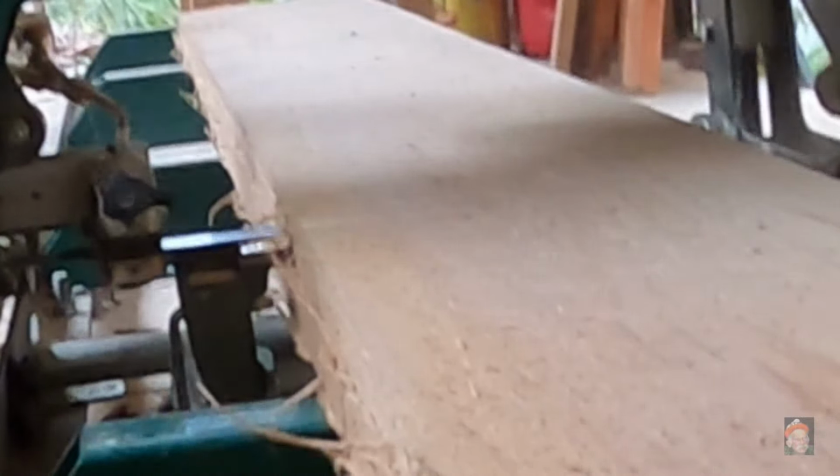I flopped the boards to put the good one on top. I used to have a bunch of wooden log stops that would be perfect for this situation, but I don't know where they are. I have only one left. So the solution is to play musical log stops. The first one is down below the board. After the blade is past it, I will raise that one and lower the next one, and so on down to the end.